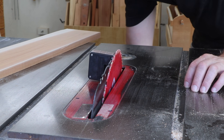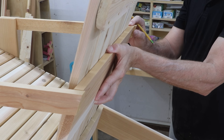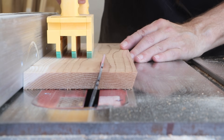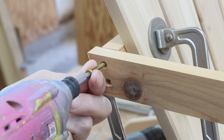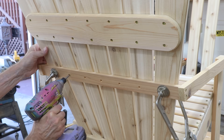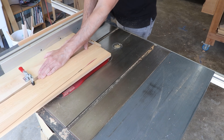I'm tipping my blade to a 20-degree bevel to cut out the support brace that goes around the back of the chair and connects the arms. I'll cut one bevel, line it up with the armrests, and mark where the second bevel goes. It doesn't strictly need to be beveled since it's on the back of the chair where nobody will really see it, but it's easy enough to cut so I might as well. I'll attach it by drilling a couple of holes through the armrest into the end grain of the brace. The wide arms are one of the defining features of an Adirondack chair, and I'll make them using my tapering jig — just tapering one edge.